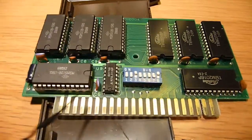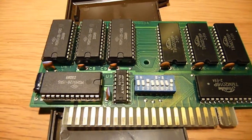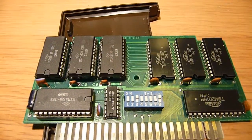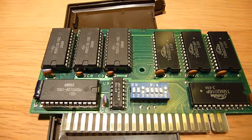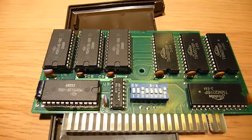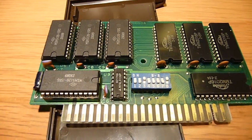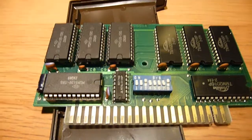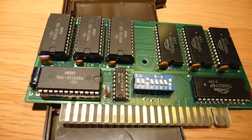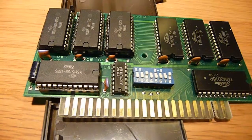This circuit here kind of makes sure that you can have two lines and decode them to a four-line decoder. It means that you can input one line. It's a semiconductor integrated circuit containing two two-bit, two-line to four-line decoders. The multiplexers have separately enable inputs providing two completely separate circuits.